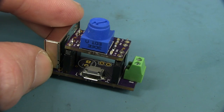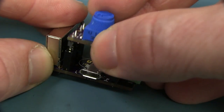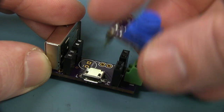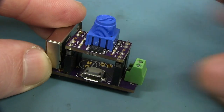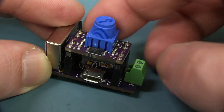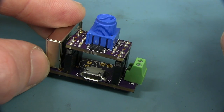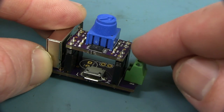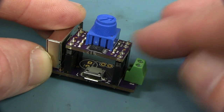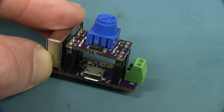and then it can automatically select between the USB or some other wired-in power source. But the other big issue that is immediately obvious is the symmetrical pin layout. I can take this off, rotate it, and put it in backwards. So unless you've been very clever and set the pinout so that it doesn't matter which way it goes in, then that's a bad move there. You even need to stagger the pins, or plug up one of the holes or do something so you can't plug it in the wrong way around.